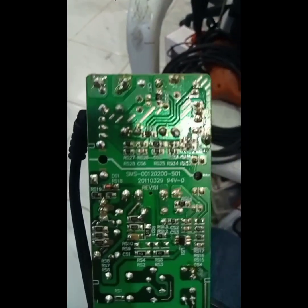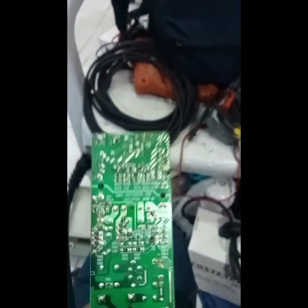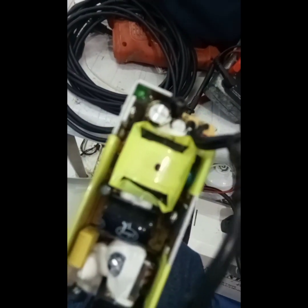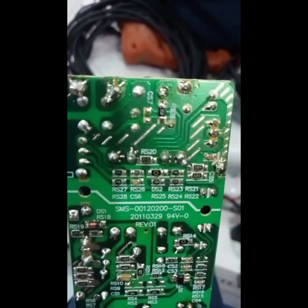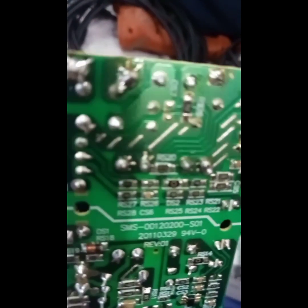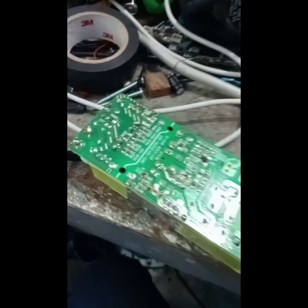I already checked all the components — it's 18 volts 1 ampere — and one thing I noticed is there are four solder joints here from the transformer. I didn't manage to solder this one because there is a crack in every joint at the soldered point. So I did solder these four joints and tested for the voltage.